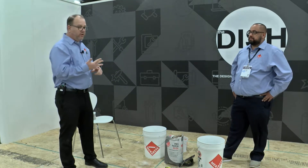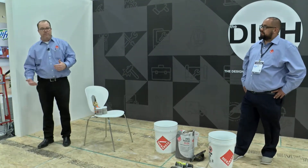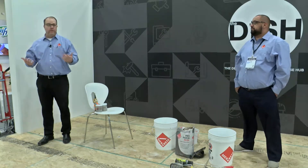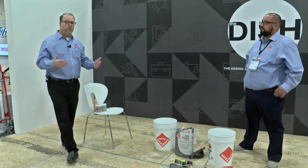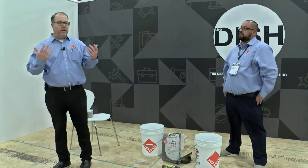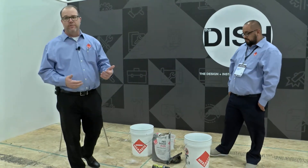One way is you can add another layer of plywood, which is recommended by TCNA. The difficulty is that you're adding another half-inch layer of plywood, and if it's in a kitchen area, now you've got appliances — once you put tile on top, you could be creating up to three-quarters of an inch height difference. That could be a problem. Another way, if it's single-story with a basement, you can go underneath and block between the joists. That's a really good way because you're not raising the height of the floor and you're not adding extra layers of plywood, but you're taking away that deflection.